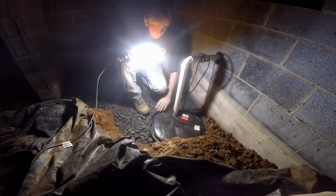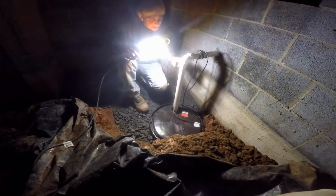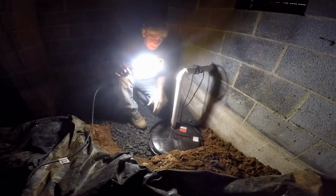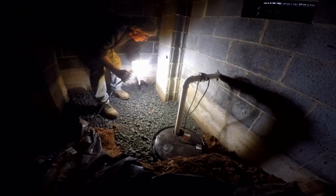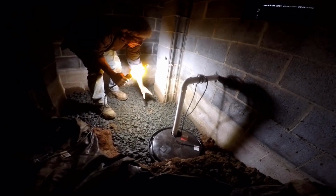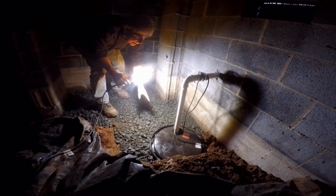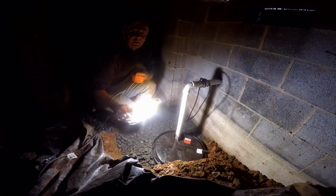And then we went ahead and plumbed the sump pump, which we've got down in there, which we showed you. Discharge line comes out through the wall, discharges out underneath the deck. We also gravelled this area, and you can see all the gravel down here. Remember, there was a flood over here, so we had to get this water to move across that concrete. We chiseled a little channel for that, brought it over to the sump pit, and we're done. Really a simple project, something that you can do yourself.